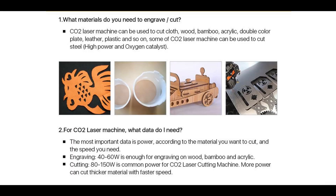Building your own laser machine requires planning and there are a few things you need to consider before you proceed. What material do you intend to cut or engrave? For example, are you wanting to cut plyboard or wood, MDF, engrave on leather, or cut acrylic? And what thickness of material do you want to cut — 3mm, 6mm, or 10mm? The thickness of material you intend to cut determines the power of the laser tube you're going to require and also how fast it will be able to cut through that material.